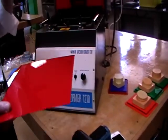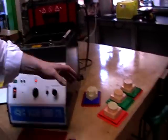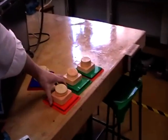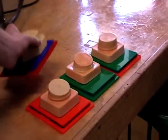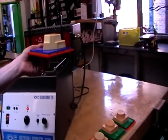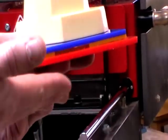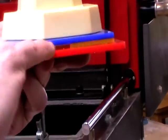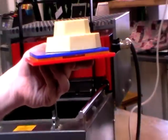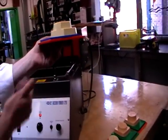So we're going to have the gloss side facing upwards. Over here we've got the formers — we've got four to choose from on this project. They're made of resin and they've all got a draft angle around the side so you can release the former from the plastic at the end. There's also an undercut that will suck the plastic underneath along that strip, which creates a natural clip for the wooden base to clip on.